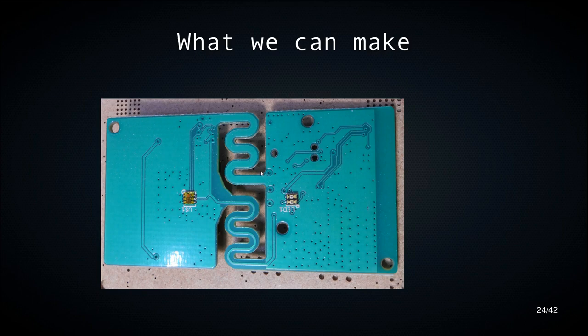So on the outside, you can have sharp corners if you need them, because you can have the milling bit go like this, and then like this, and you're left with a corner. But when you're on the inside of the board, when you're making a cutout inside the board, you cannot have sharp inside corners.